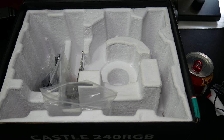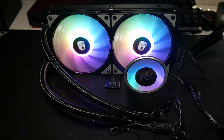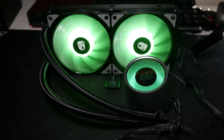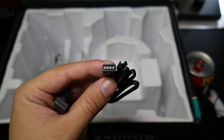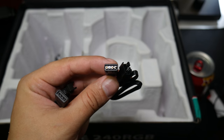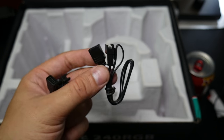But if you want to sync it up to your motherboard, there's actually two options, and this is one thing that I was really happy with when I unboxed these CF120s. Now, with RGB, you're used to the 4-pin layout, 12-volt RGB. Now, these are 5-volt RGB, and different companies are using different headers. For Asus, for example, they use a 4-pin width, but one pin is missing. I also think this is the same for MSI as well, quote me if I'm wrong in the description, but that's what they use for addressable RGBs.